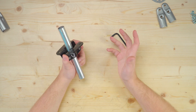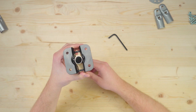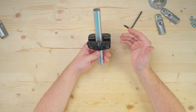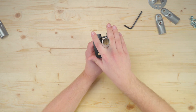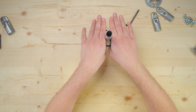Because the two pieces in this flange are designed to clamp together, you have some mounting flexibility. You can clamp the flange anywhere along a piece of conduit, whether on the end or somewhere else along the pipe. We often see builders drill holes through wood and other materials to allow spans of conduit to continuously run through them — this community shelf is a great example of this technique. Because you can clamp the flange anywhere along a piece of conduit, you have possibilities for attaching and securing flat surfaces throughout your builds, such as resting a piece of wood against the conduit and securing it to the flange underneath.